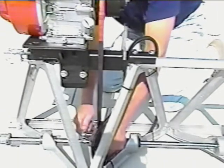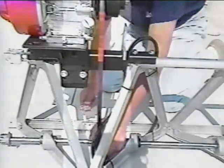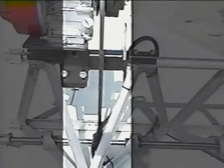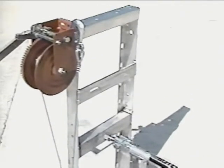Belt tension is critical to proper performance. With the engine shut off, adjust the belt so that it is just loose enough to touch the inside surfaces of the belt together with finger pressure. One of the most common assembly errors is to adjust drive belts too tight. If the belt is too tight, it may smoke and burn. At this point, install the end brackets and winches.